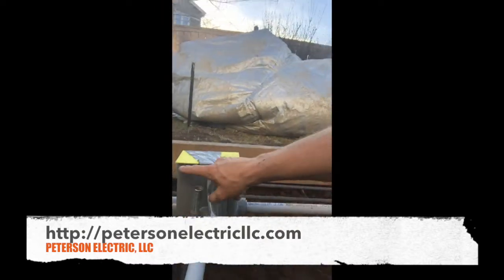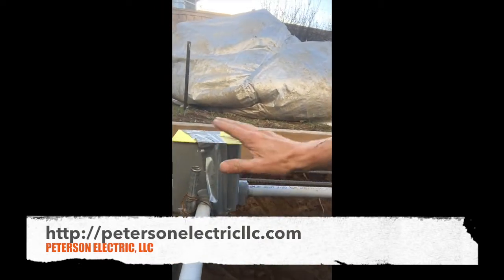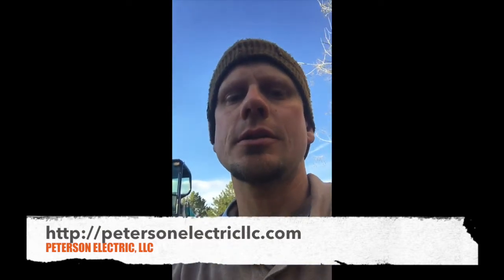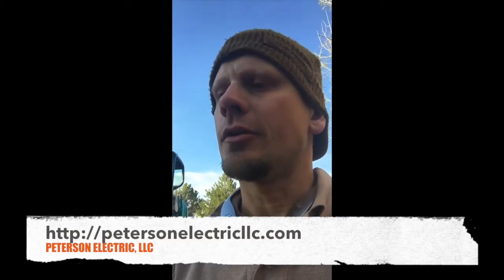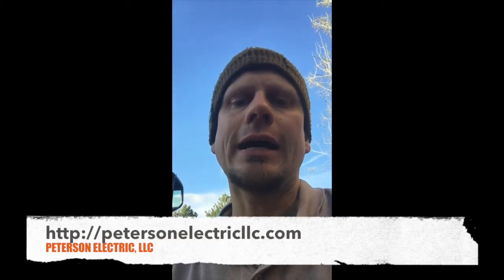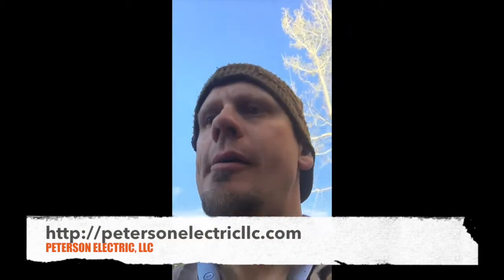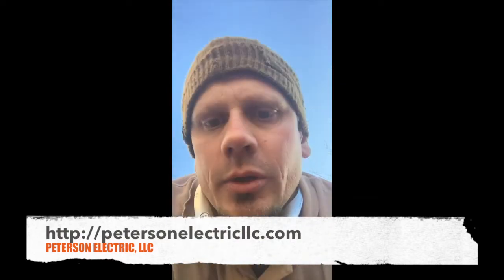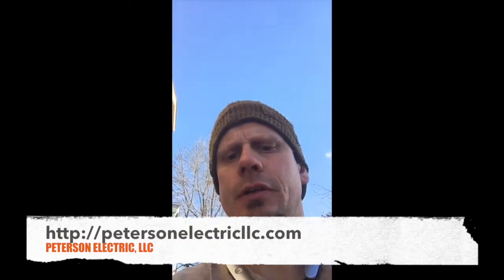These boxes can be ground down and outlets put in. We'll protect that circuit with a GFCI/AFCI combination type breaker at the panel, because it's going to be in the floor and it's tile, so people mop. That's our Ufer ground, that's our underground, and I'll keep you posted as we go through the rough. Thanks.